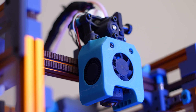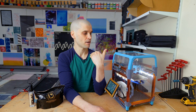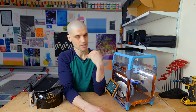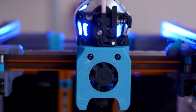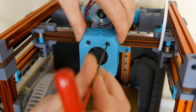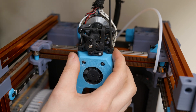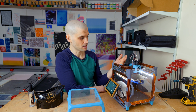So the next modification was swapping out for the Mini After Sherpa, which splits the hot end and the extruder into two separate components. When I first had to take apart the Mini Afterburner, the nylon gears on the extruder had stripped and were skipping during extrusion — you had to take apart the entire thing to access it. With the Mini After Sherpa, you can take apart the extruder without touching the hot end and vice versa, making maintenance much quicker and easier.